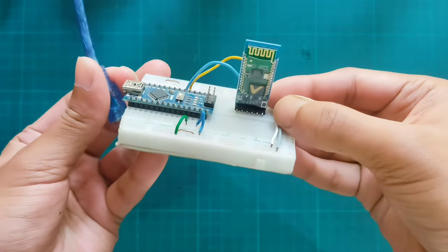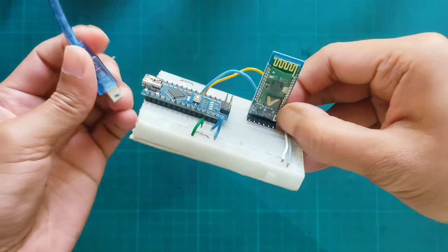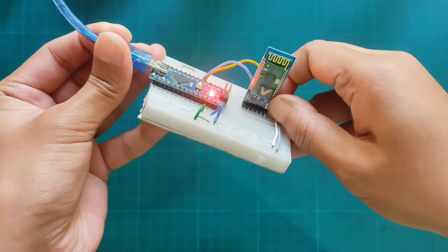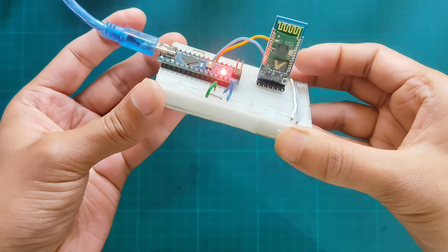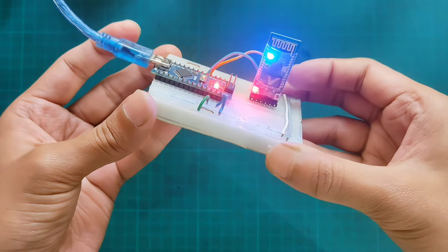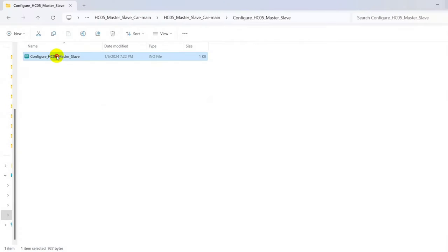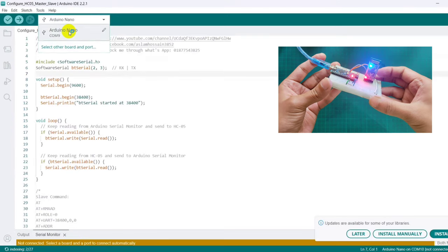To bring the HC-05 in AT mode, press and hold the enable button and connect the USB cable to Arduino. You can see the status LED blinking slowly. That means the HC-05 is in AT mode. Then open the configure code given in the description and upload it to Arduino.